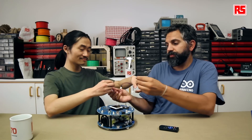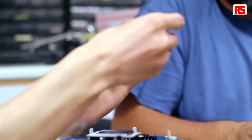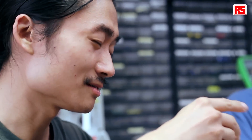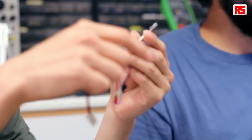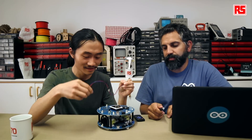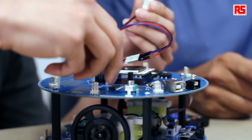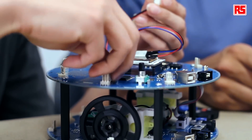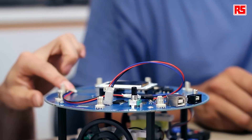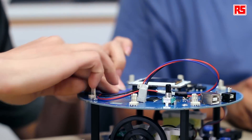So let's first connect the infrared receiver to the cable. It's just like a normal component. So this platform is very extendable. It's just connected to port D2 as the sketch says. And it's good that we tape it in a good position so it will not move around.